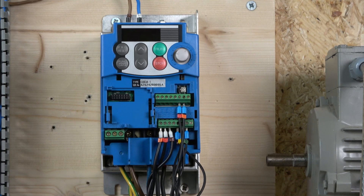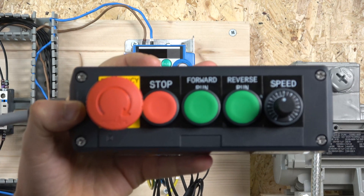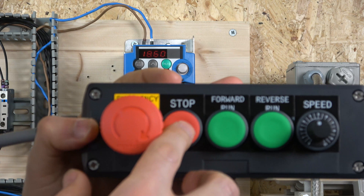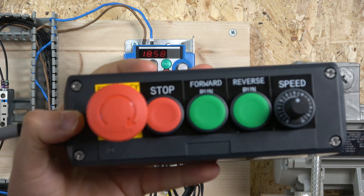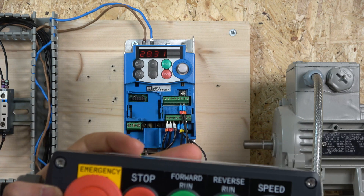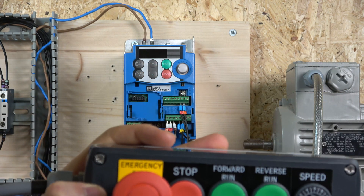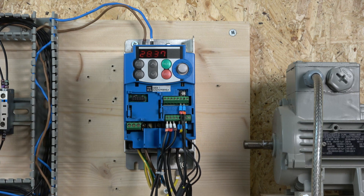Cover is on — let's see how it works. We press start forward and it latches in and runs the motor. We stop it, then run in reverse. Note that you have to stop it before going the other way. The potentiometer controls the speed. To demonstrate the quick stop — there we go, it shuts the motor down immediately from the controls and it will stop. You can then restart it back up again. That's pretty much how 3-wire control works.